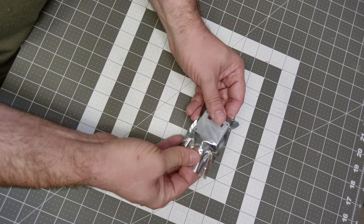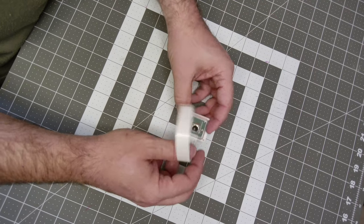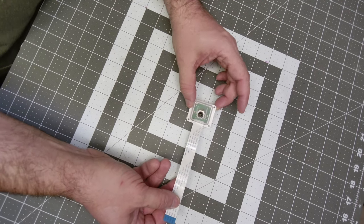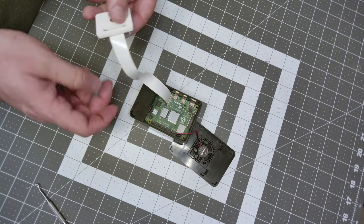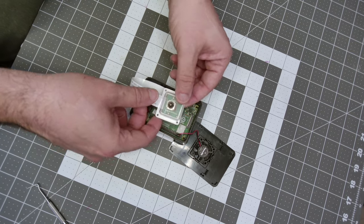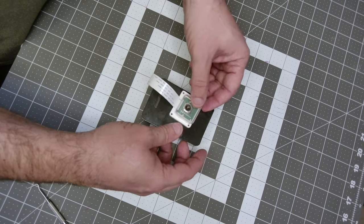I used the Hawkeye to build this Frankentraption, and I'll cover the details of this monstrosity later on in this video. Unboxing is simple — it just includes the camera and the ribbon cable. I'll be doing my testing with a Raspberry Pi 4, and physical setup is very straightforward. Just plug the ribbon cable into the Pi's camera port, making sure the blue side of the cable faces the Ethernet port side of the Raspberry Pi.